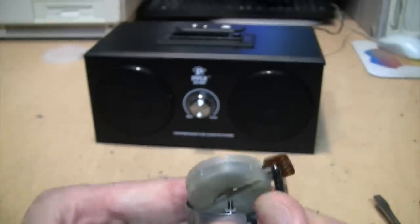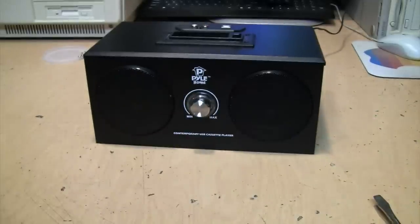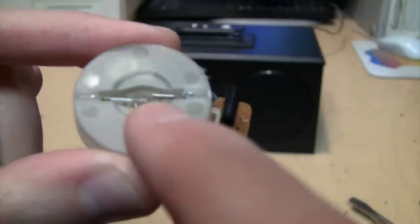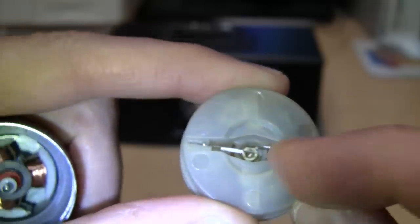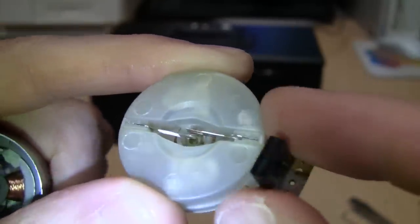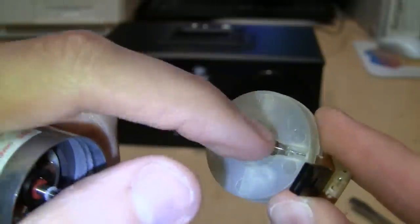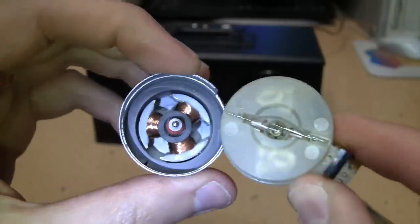If you're lucky you may be able to just pop out the whole circuit board assembly, but on some of these you'll have to pry it out. You have to be especially careful of these little metal fingers — they're very delicate. The object is to get a drop of oil into that little recess, because that's where the end of the motor shaft goes in. It's basically just metal into plastic with no lubrication, and that's why these things are so noisy.